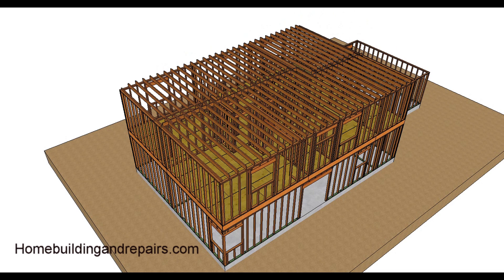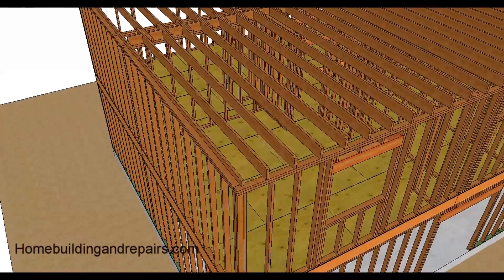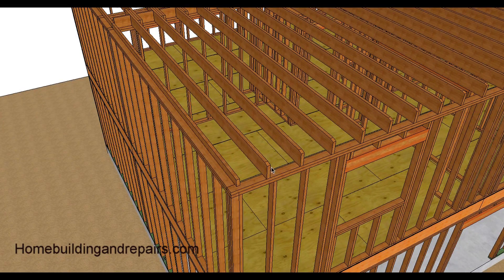Back to our roof — roof's gone. Take a look at our ceiling joists. You might have to notch the ends of these so that they don't protrude past the edge of the roof or past the roof rafters. Here's the two-by-four I was talking about.